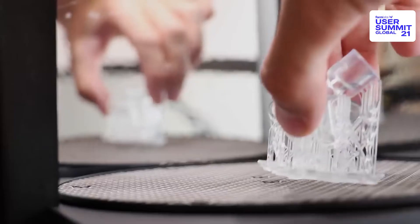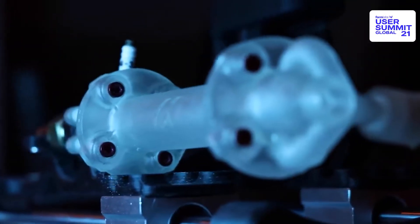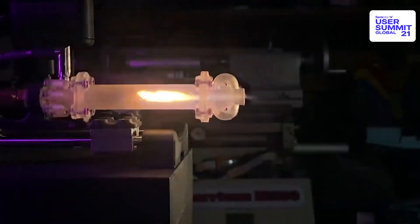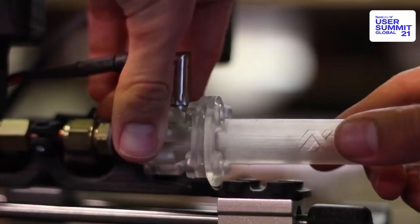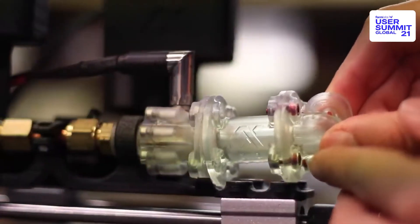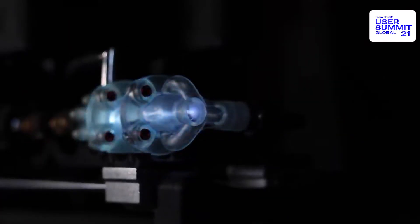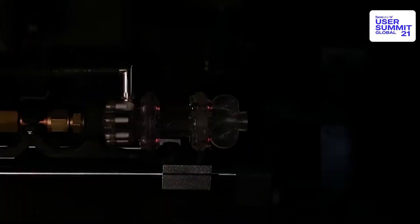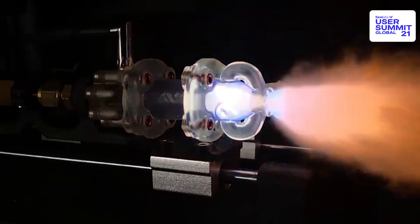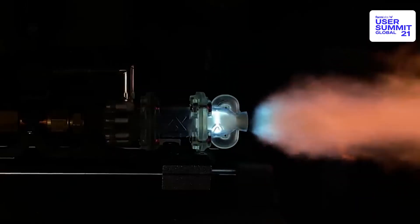The chamber was designed to be modular so we swapped out the shattered nozzle. These first tests with a long chamber showed that the characteristic length of the chamber is too long and thin to sustain a strong swirling vortex. Modularity helped again here, allowing a shorter chamber to be swapped in. This worked much better, easily sustaining vortex combustion. In one test you can see ignition and a slight vortex, then the combustion shifts to outside of the chamber — the flame looks spectacular but it's not producing any thrust and is no more than a blowtorch at that point.